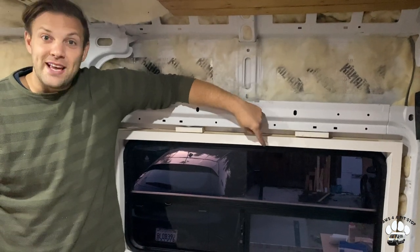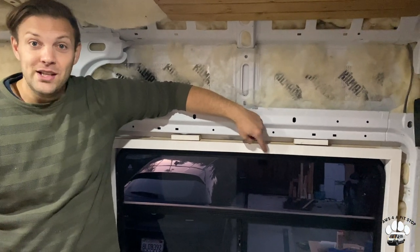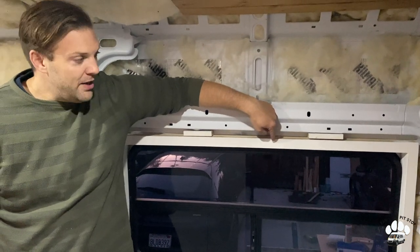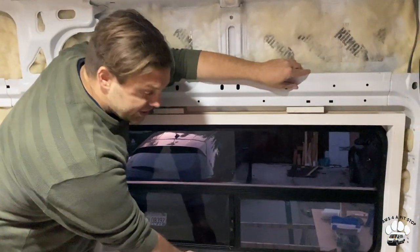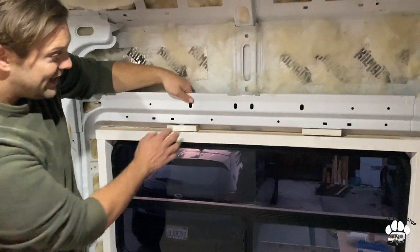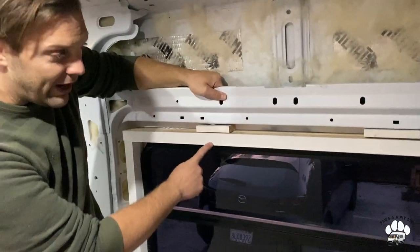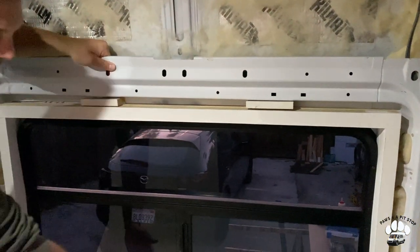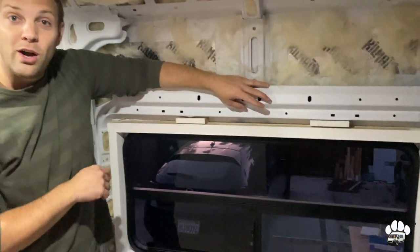So just kidding — I know that we said we were going to use some liquid nails and basically glue this to the wall, but that wasn't going to work. There's not enough contact points between the frame and the wall. So what we've done is we've added a couple of pieces here to secure it from top to bottom, basically — through the wall, into this little piece, into the frame. It's very secure; I'm pulling on it right now. So we're happy with how it is, and we are ready to start framing it with our wall panels.